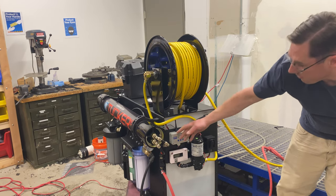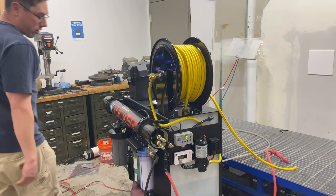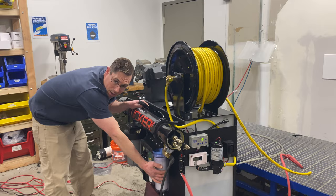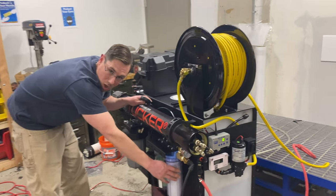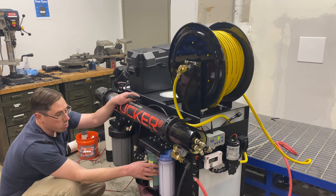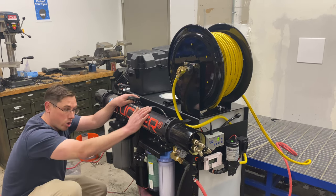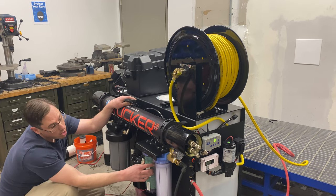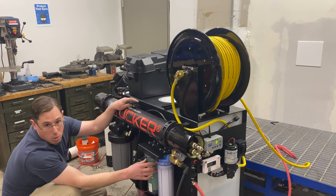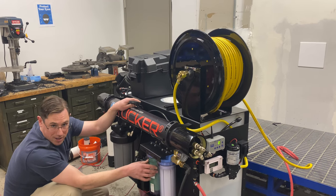This is currently in flush mode. After your pre-filtration, which consists of your sediment filter to catch heavy rust and particulate, your carbon filter will either de-chlorinate the water to protect your RO, or these catalytic carbon filters will remove chloramines which your municipality may be using to disinfect the water.